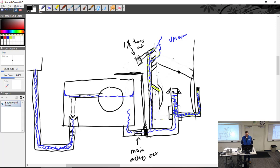So if the carburetor is set up correctly for idle speed and idle mixture, and I pull the red knob out, the idle cutoff, all the way back, what should I see? I will see a rise of RPM of approximately 50 to 75 RPM, and then it dies. You have to watch closely and listen carefully because it doesn't go real slow. It goes here. It's like, whoa, that was quick.